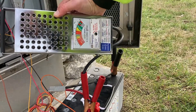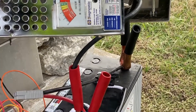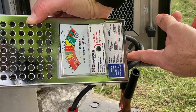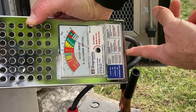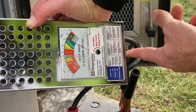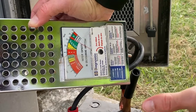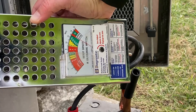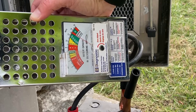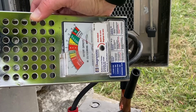So let's focus in on that. Like I said, you've got about 13 volts. I'm going to hit this switch here. With the load on it, we're still hovering around 12 volts. So that tells me that this is a good battery. I'll test the other three out to make sure, but if they all come back like this, that's a good system.